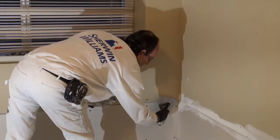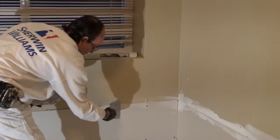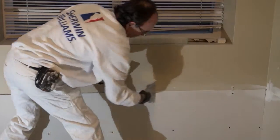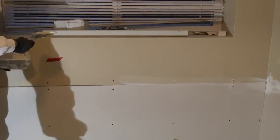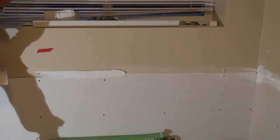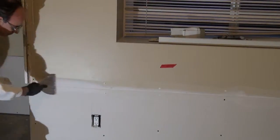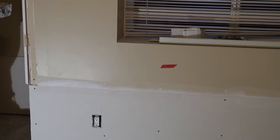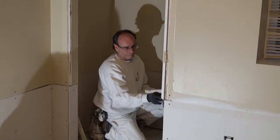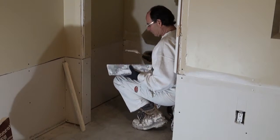Take a little bit of mud, just put it on, and it should be filled. Lay it on like this as well. We're going to continue on in the closet here. In the corners there's also a gap, so we're going to want to fill that out too.